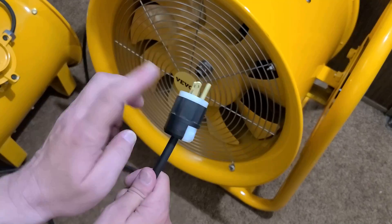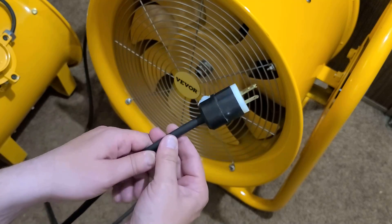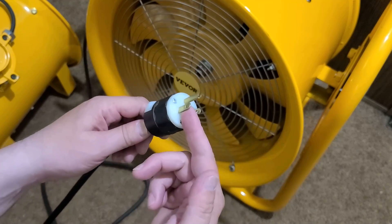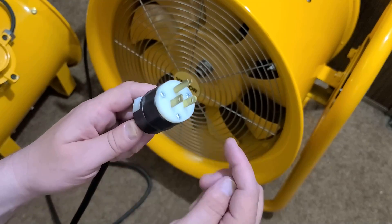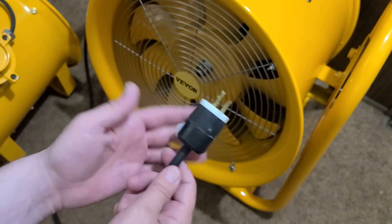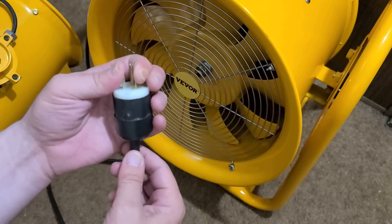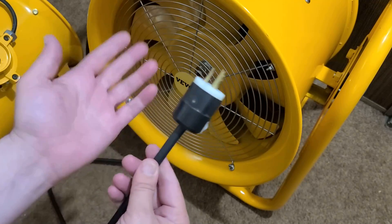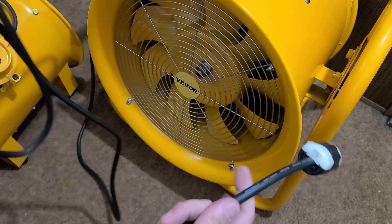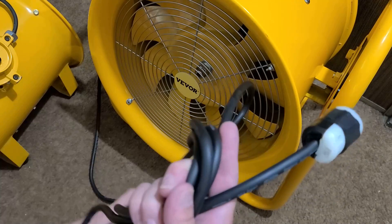You have to wire in your own cord, and I think that's because of the variety of installations — even though it's 110 volts, you may end up using a 110-volt twist-lock plug or plugging it into a 20-amp circuit. There's a lot of surge current for a one-and-a-half horsepower motor, so it would be better if they offered a variety of plugs, but for simplicity they include it without a plug and you supply your own. This uses 14-gauge wire; the 12-inch uses 16-gauge wire, so it is a bigger upgrade.